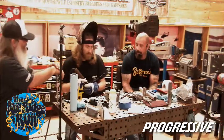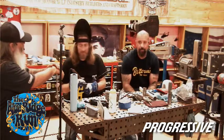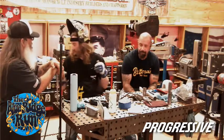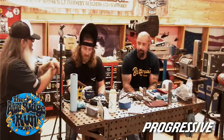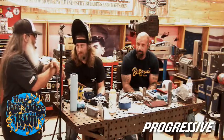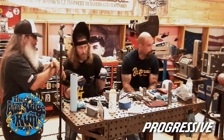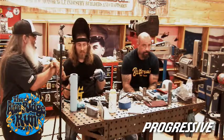Yeah. And then when you get into aluminum, tungsten prep is a whole other animal in itself. Some don't ball it. Some allow it to ball on itself. Some turn the machine on DC positive, and you can put it on a piece of steel straight up, lift it slightly, hammer the pedal, and it'll ball it. Right. And you turn it back to AC, and you have a perfect shiny ball on it. There's a bunch of different techniques, but I'll lay this in there, run the same style fusion weld. It shouldn't be as sunken in.